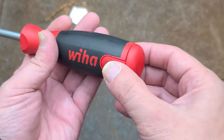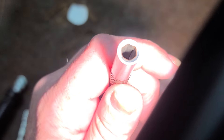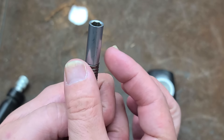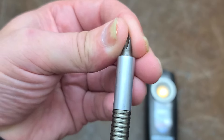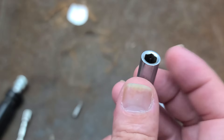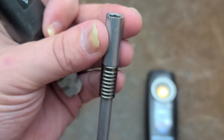Even though it is neat in some ways, it is ill-fated — primarily dealing with the whole internal bit storage system. It's locking, but it's an interesting type of design. There's a little finger in there; they've carved a couple of little tracks and these fingers push in to lock the bit into little tiny cutouts that are standardized on quarter-inch bits. It will accept a one-inch bit. It's not magnetized, so bits don't get stuck in there.